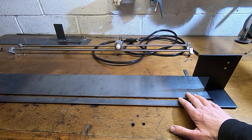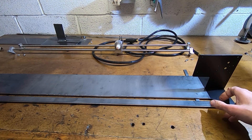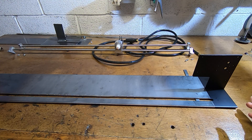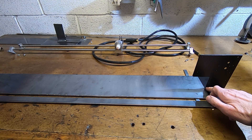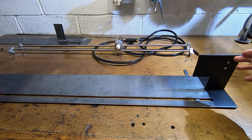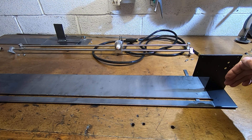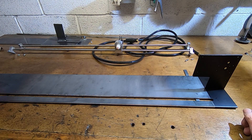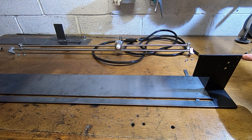In the previous video I got the base plate assembled and welded on the side cheeks. I've only welded it from the back, so there are only welds running along the back of the plate. If you've done any welding, you'll know that if you put a weld on one side of a joint it will tend to pull the plate back — as the weld cools it shrinks and you end up with an angle you didn't intend. I knew that was going to happen, so I started off with the plates angled forward at the top.